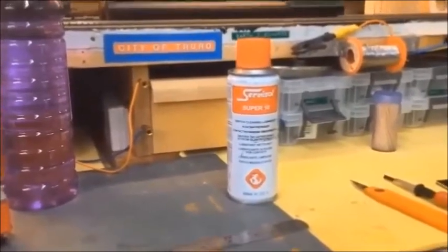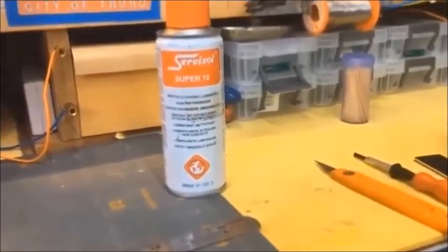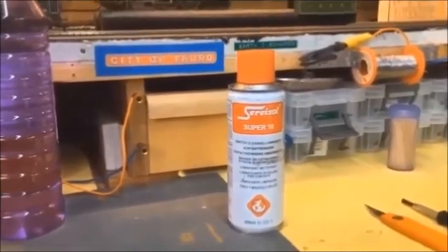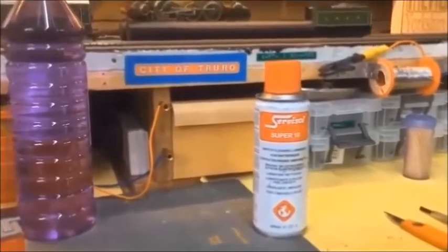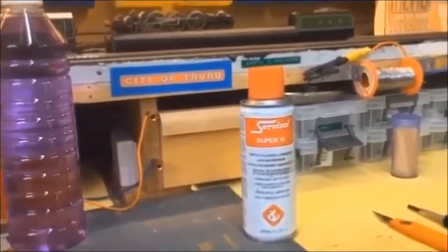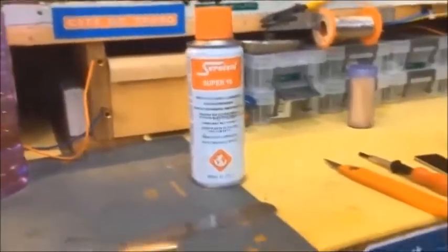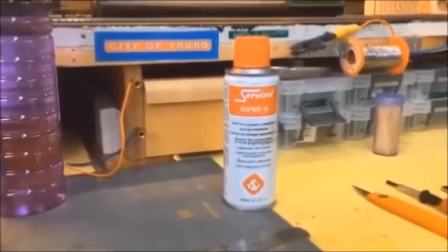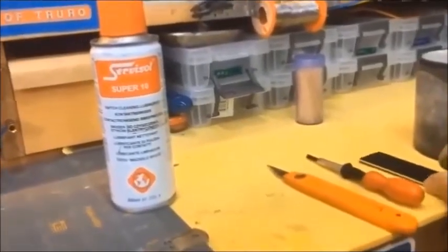This is an electrical contact cleaner, but it's also got a slight bit of lubricant in there. What the lubricant does is form a slight coating when you've left it behind and cleaned all the crud off. It keeps a coating to stop the oxidisation. Now, the oxidisation is a result of the electrical microarcing on top of nickel silver rail, which readily oxidises, or in other words, rusts. If you want to know more about this kind of process, there is a video below that I'll share the link with, for which I'm eternally grateful, which discusses this in quite some detail.